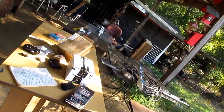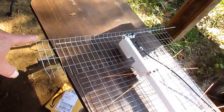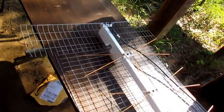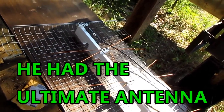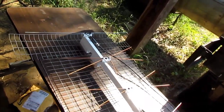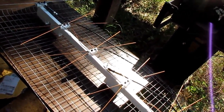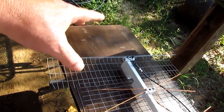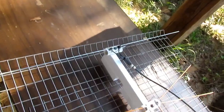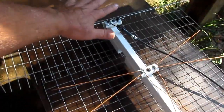A man the other day asked me in the comments — he said, why should I make this antenna with the UHF? He said, I'm getting all the channels. Well, he don't need it. But you might be in a spot where you do. Now, that ultimate antenna does pick up VHF and UHF and it does it pretty good. But I guarantee you, I bet this antenna set up like this will outdo the ultimate antenna, because this is focused on UHF alone and that's focused on VHF alone.